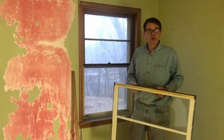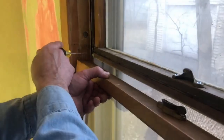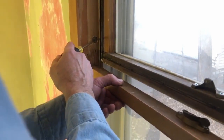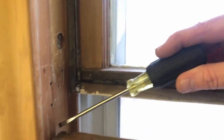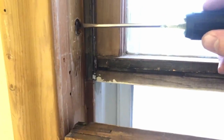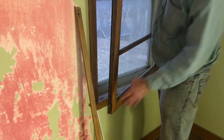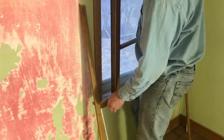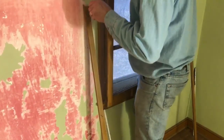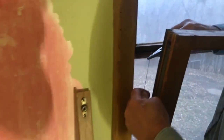I've reglazed the window and now I'm ready to put it back in. I want to show you where and how these two pieces fit. We need to engage that metal piece on the window with the metal piece that is the parting strip, and we need to do that after we've connected the spring-assisted sash cords. Here is the metal part of the window, here's the metal part of the parting strip, and here's the attachment point for the spring-assisted sash cord. The first thing we have to do is take the spring-assisted sash cords and pull them out very slowly — it is pretty tight — all the way out until we can hook it back on that little post.